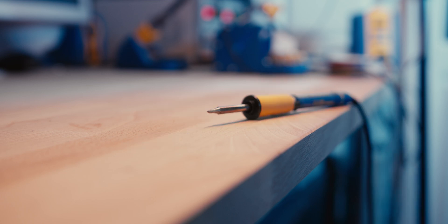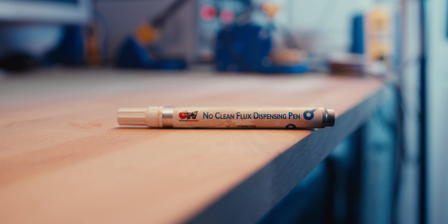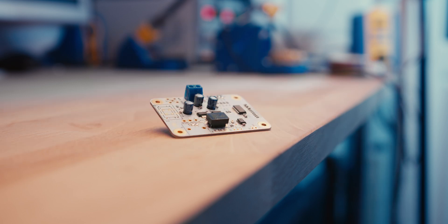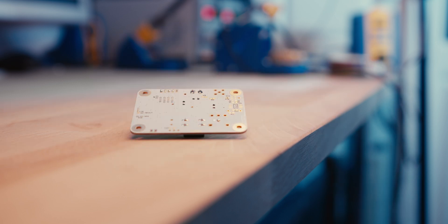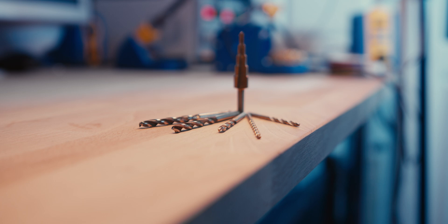And just to be clear, what I'm about to show you is applicable to almost any AVR. You're going to need a few things: a Phillips head screwdriver, a soldering iron with a bevel tip, some 0.8mm diameter flux core solder, some flux in a pen-type applicator, some AWG 30-ish stranded wire ideally in multiple colours, a WM8804 SPDIF transmitter board with both M1 and M2 jumpers unbridged, a female panel mount RCA connector, a decent set of HSS drill bits, and the blood of your firstborn. Links to all of these can be found in the video description.